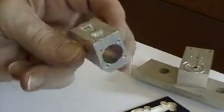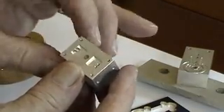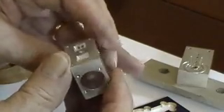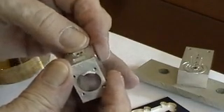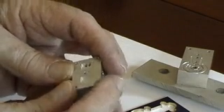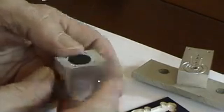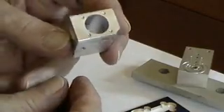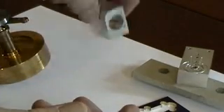This is the cylinder block. I have increased the volume of these cavities here in order to increase the breathing into the cylinders. Instead of a single rather larger hole, I have drilled two angled holes. The area of these two smaller holes is actually considerably larger than the larger single holes, so I think it will breathe better. I have finished that — it looks very nice and is ready to be assembled when I finish the rest.